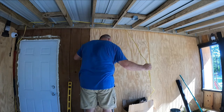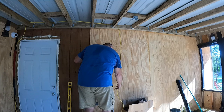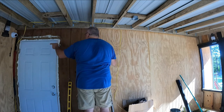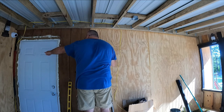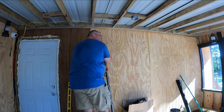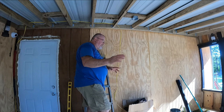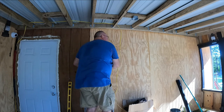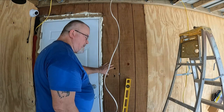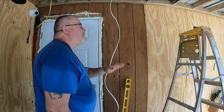Let's come this way — I still got to get this T111 secured. Right there, that's plenty. Now we'll go in there and cut that, give me some extra so I can tap into that existing outlet that's in there. That won't be used that much, but it will when I make that an office. That's my plan for that room once I get the washer and dryer out — make it a little office with maybe some storage. Found some 14-2 wire — that's all you need. You don't want to waste good 12-2 wire on a light switch; you don't need much juice for that.